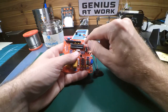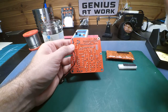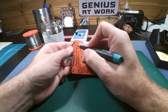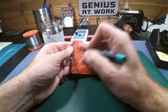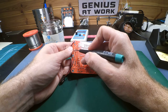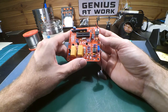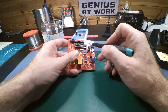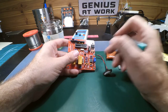We have three plates. Turning around, we can see the top plate and side plate are connected and go to the middle pin of the 7805 — that's ground. The other connection goes to the first pin, which is the input of the 7805. So that's negative and positive sorted.